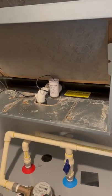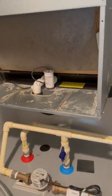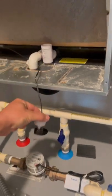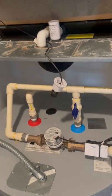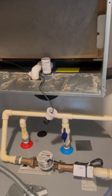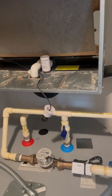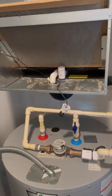It's alright to leave it disconnected just for the evening to get the AC running overnight, or through the weekend. Take the float switch and remove it — let it hang so the float is facing down. Do not return it. We will vacuum it out and do some maintenance the next business day. Give it about three to five minutes to start. If it doesn't start, let us know.